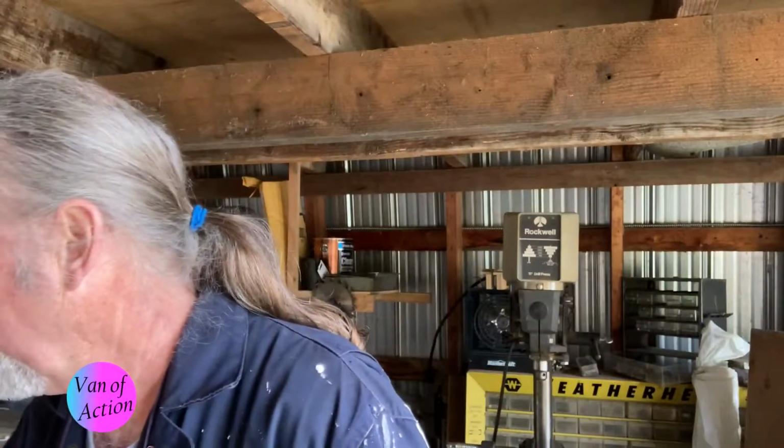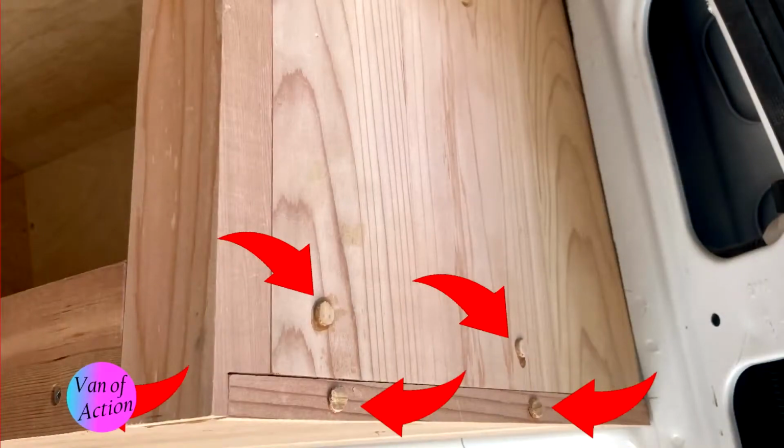I took these skinny pieces of wood and I went to the local lumber yard, not hard to find, and I bought a plug cutter, looks like this, and I bought a drill that'll drill exactly the size of hole the plug cutter cuts a plug for. They just fit together. Sometimes they come as a set. Lee Valley would sell them as a set, but it's possible to buy them individually as well. With these two tools, you can drill a hole anywhere you want in the field of your wood, and you can put a screw in it and fasten it and hide the screw when it's done.